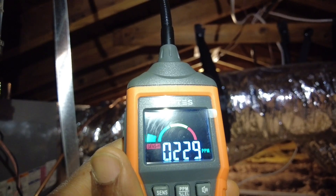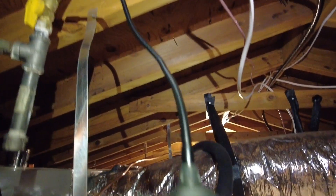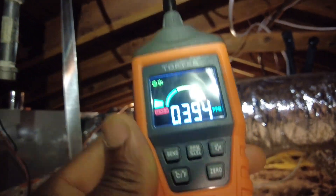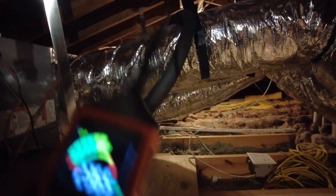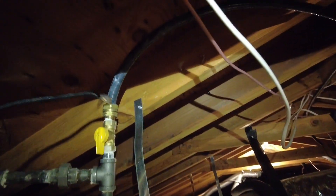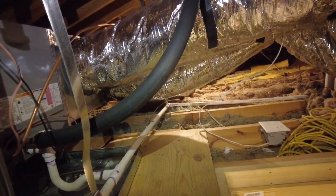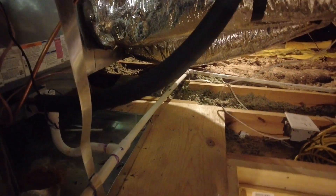See that again — it looks like when you pass about a thousand parts per million, it starts beeping. Otherwise you're not getting a beep. It's a big leak too. You can see where the leak is here, up at the top of the fitting. Let's see if it's smellable — oh hell yeah, you can smell that one.